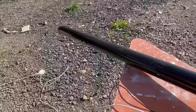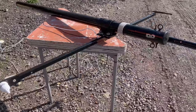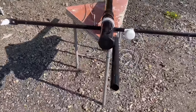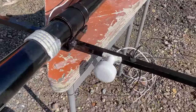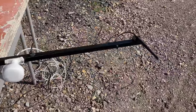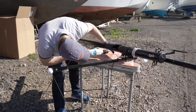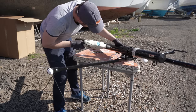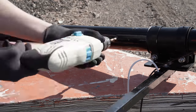Now for everyone's favourite chore, cable management. They're all a bit different, some stiffer than others, which may impact how I route them. I do have a few aims. I do not want half a dozen different glands needing to be fitted. I want to keep the inside of the mast dry. I want to avoid the cables being damaged when inside, and I want to be done with all this before supper time. My solution is one large waterproof nylon screw gland. All the cables will just fit inside.